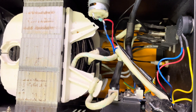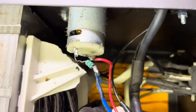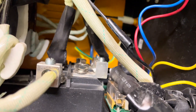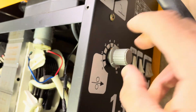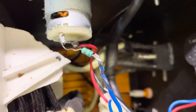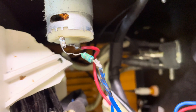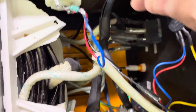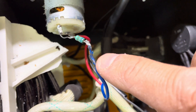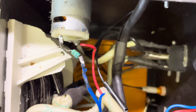It really reduces the amount of spatter and flashing. The other issue was the wire speed — this is the wire feeder motor, and it feeds out of the circuit board right here. Instead of messing around with the knob in the front, I decided to add a resistor. I got this resistor from an old Nokia phone charger — it's about 10 ohms. When I measured the resistance between the two poles of the motor it was about 5 ohms, so adding 10 more ohms will drop the voltage and allow a slower speed with better control.